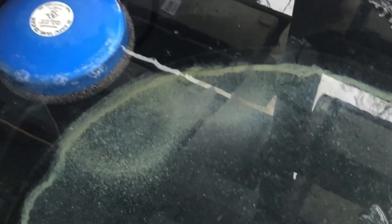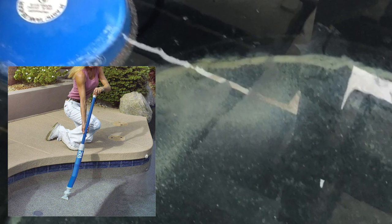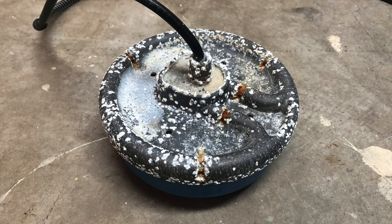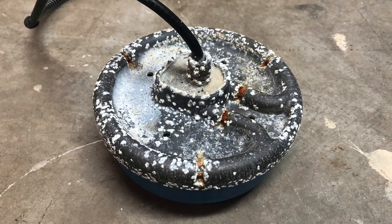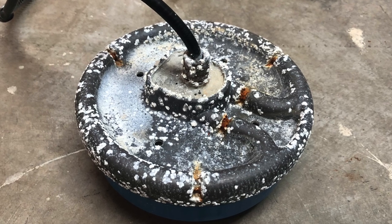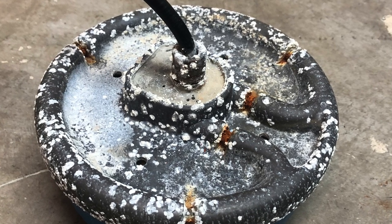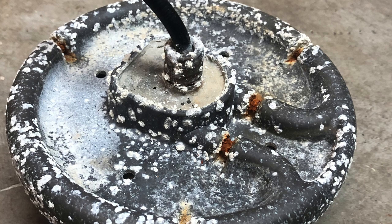Short of leaving it in, the other options are to drain your tank and wipe clean, or to invest about $40–50 in a hand suction pump made for spas and hot tubs — with that you can easily siphon out all the debris from the bottom of the tank. You'll also most likely notice that same calcium buildup on the underside of your de-icer. Again, totally normal — it's the heating element attracting the calcium. Manufacturers even recommend periodic cleaning to ensure maximum performance. It's important not to let the buildup cover the entire element, as there's a risk your de-icer will burn out due to its inability to disperse heat.